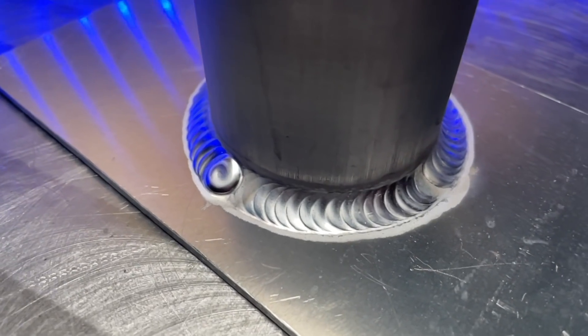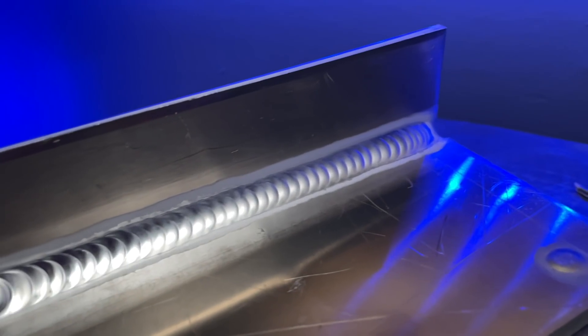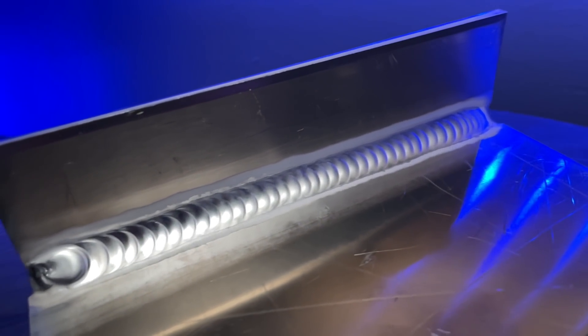When I am welding, I only want to focus on my welding — I don't want to have to pay attention to any other variables once I begin moving. The same thing goes for going around pipe. I'm always going to put my tack at a stop point, a start point, or most likely both. Plan this detail out. When I get set up for a project, I spend a good amount of time just staring at it, thinking about where I'm going to put all of my tacks. I always thank myself for doing it later when I can just focus on making my welds look good, maintaining the size and profile I want, and throwing down nice uniform passes.